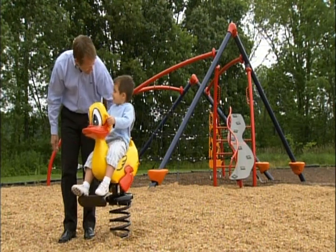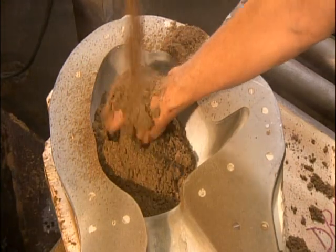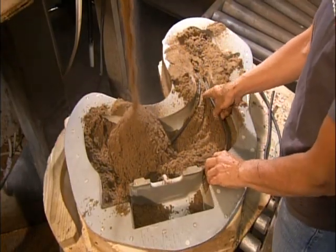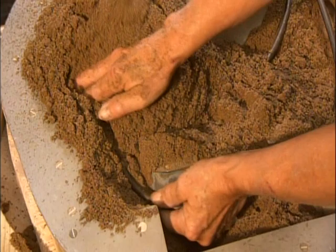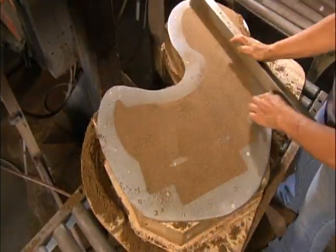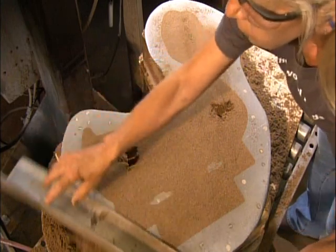The sand core is comprised of two halves, each made with an aluminum mold — duck-shaped in this case. Workers fill it with a sand and adhesive mix that sets into a solid block. They insert several steel support rods, fill to the top, and even out the surface, then expose two hooks they'll grab to extract the core half once the sand hardens in about 20 minutes.